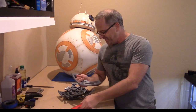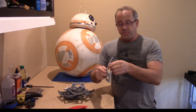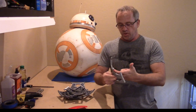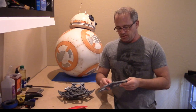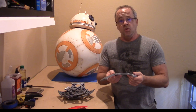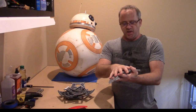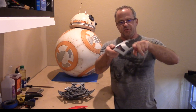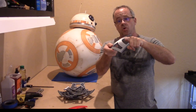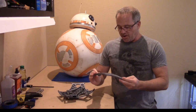That failed - didn't work. It went from there to a design where I actually had tabs sticking out, which is nice because you can just run the screw through it. But I'm going for a production version of this, and the issue with something like this is when they make the tool, it's essentially two big pieces with slides that pull out to create bigger holes. It's impossible to have a slide for the center hole, so you couldn't actually create that hole in the rib.